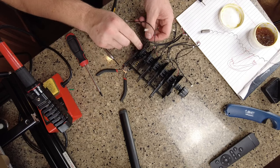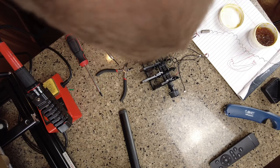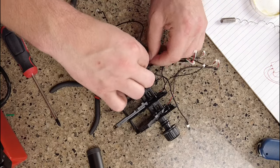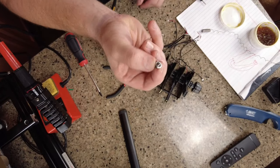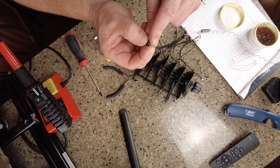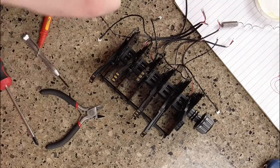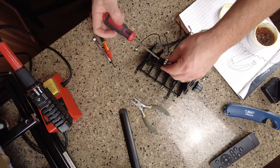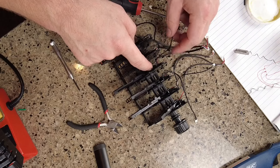The whole thing is that they just need better wire routing so the wires have a way to move — that's what I see as the biggest problem here. And if you're watching this, Honeycomb, take some notes because you're going to have a lot of people calling you. I'm not going to put in the detent balls just yet — I'm going to wait until I get them all done, then go back and put all these little detent balls in. That's where you get that last detent for the lower switch on the Bravo. It's a poor design to do it this way.